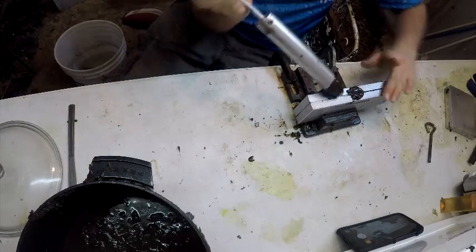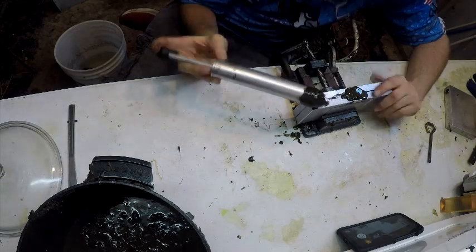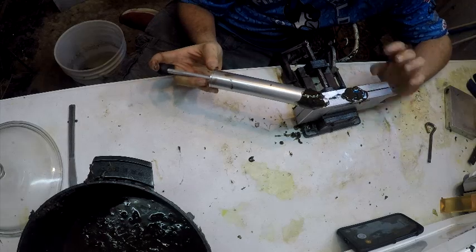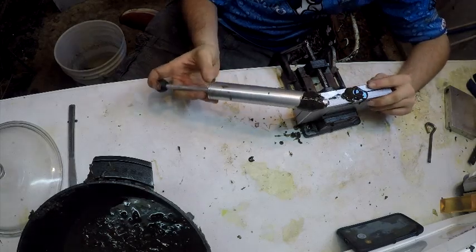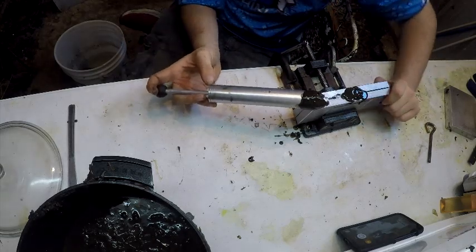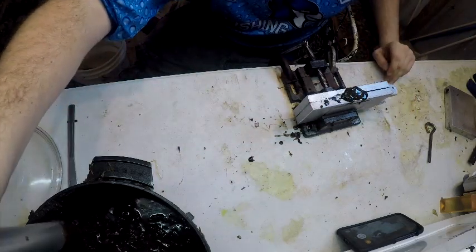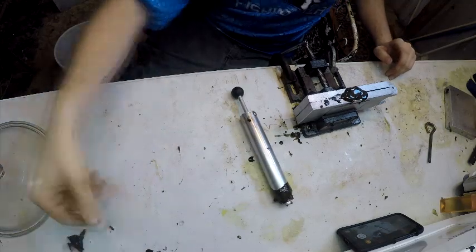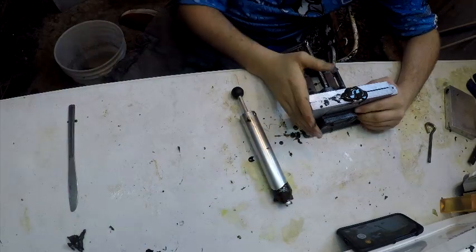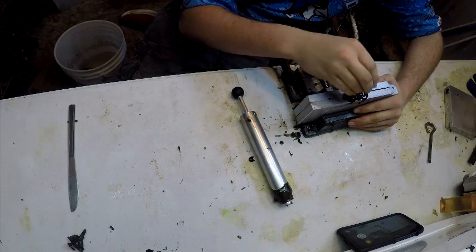Now on this exact mold, it will suck the sprue and create air pockets and will overfill a ton. I will keep plastic in my injector so once it starts cooling inside the mold I can refill the sprue. It's starting to dimple down — just refill it, then empty out your injector. You're going to wait about a minute, minute and a half for this to cool inside the mold, then you're going to want to move it into a water tank to finish curing.